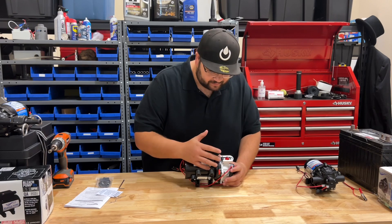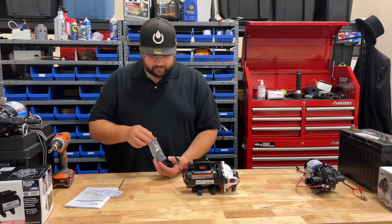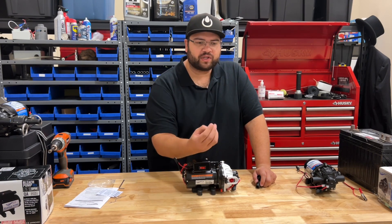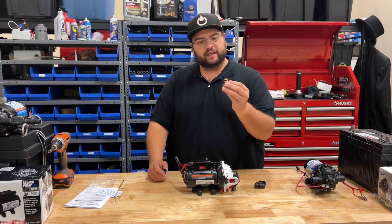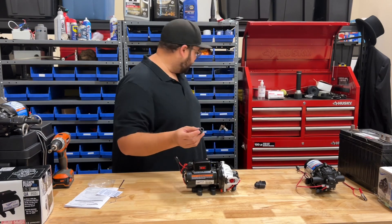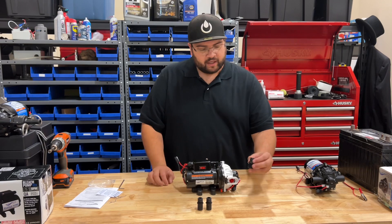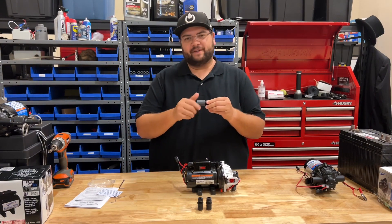The other thing I was really excited to see for the first time was these quick connects — and that's what these things in the bag are. So you're going to get some quick connect fittings, very similar to garden hose quick connect fittings. This is a three-quarter inch plug, and then you have a three-quarter inch barb on this side. You get two of those — plug to barb — and then you get this one, which is plug to an NPT connection, and this is going to be a half-inch NPT connection. These are going to be three-quarter inch barbs.